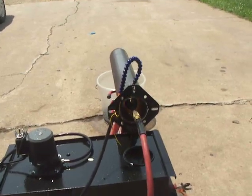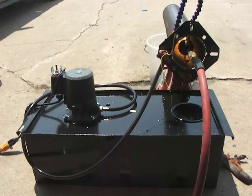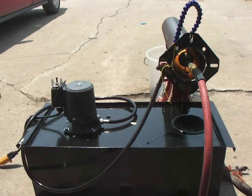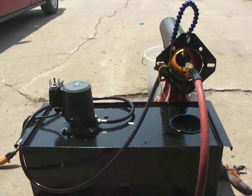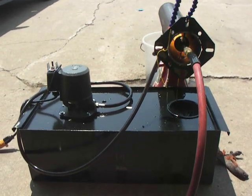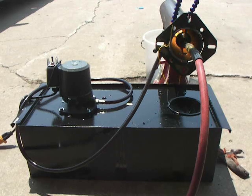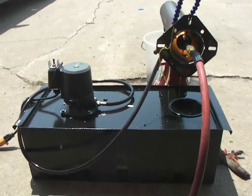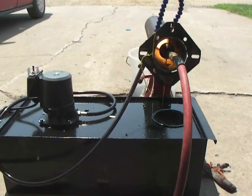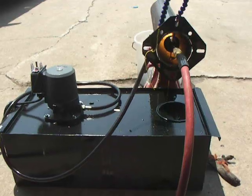Here's my source of heat for this winter. I made this Babington ball burner after reading about what other people had done online. I'm using a four-inch tube that flanges off of a Beckett burner, because I'm installing this into a boiler that used to have a Beckett oil gun. I got the tank from Enco — they sell machining supplies — it's a tank meant to pump coolant up for cutting tools. Right now I'm using a single ten-thousandths-of-an-inch hole and burning diesel fuel, although I will be setting up a heating system to burn waste motor oil.